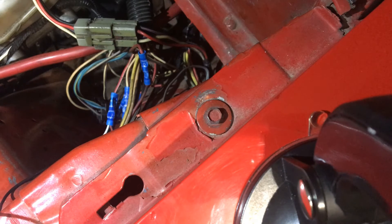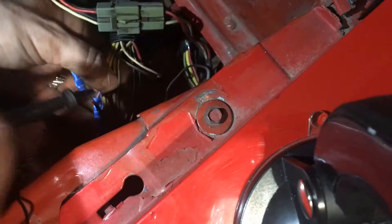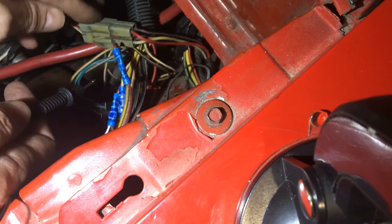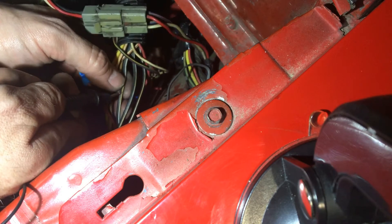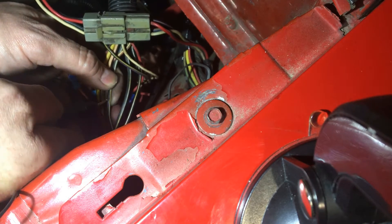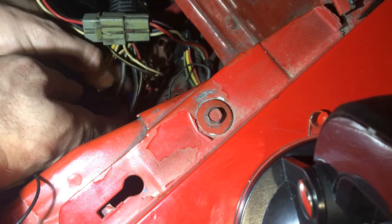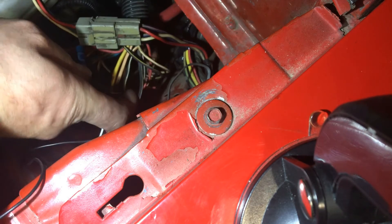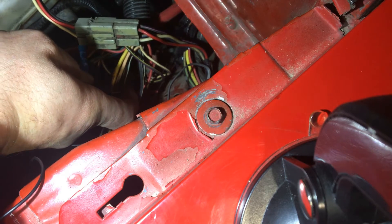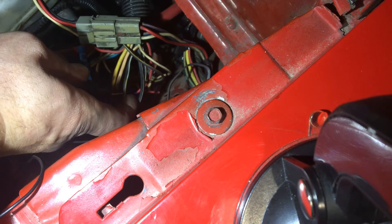I'm actually going to probe into the wire first - you're poking through the insulation to hit the actual wire, just like these right here. I'm going to poke into it - you'll just poke into the insulation and try not to poke your finger in the process because that doesn't feel good. I've stabbed myself many times doing this. You get the wire in there, hold it on there, touch your other point - hear that? That's continuity, so that means we're touching the same thing on both sides of the meter.